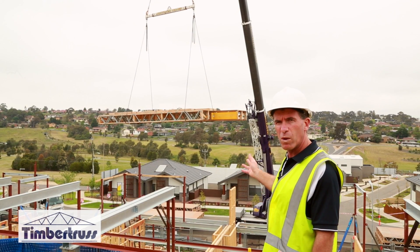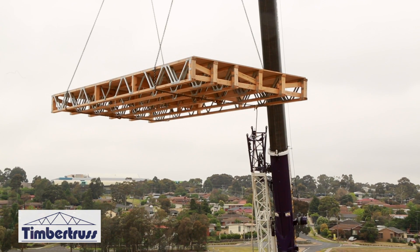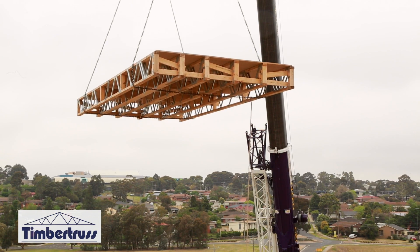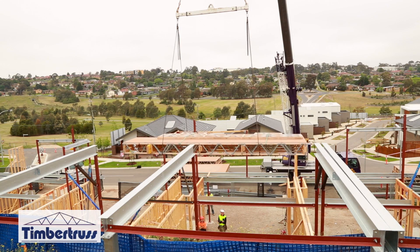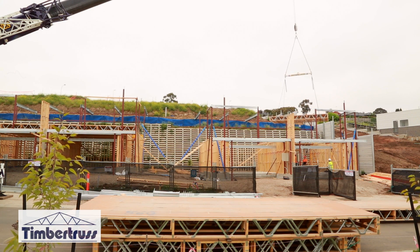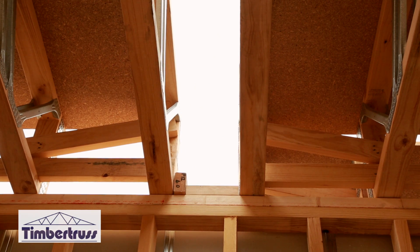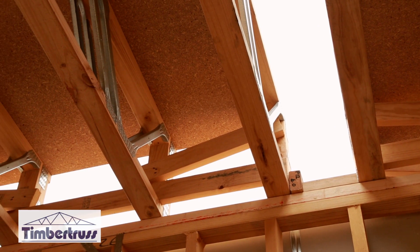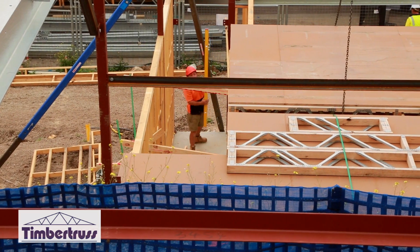These are all engineered from our MyTech fabricator to make sure everything is permissible for the crane company. The weight is distributed and given to the crane operator so he knows what he's lifting, and there's an indication of which way the cassette has to be dropped in. You can see we've got a gap here — that allows for play for the builder so the cassettes are not hard up against each other and we don't have a creep factor. The builder will fill that gap with loose flooring supplied to finish the floor.